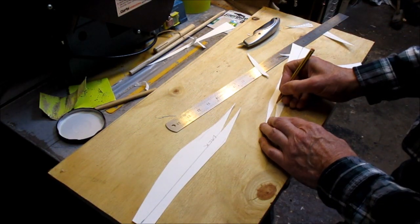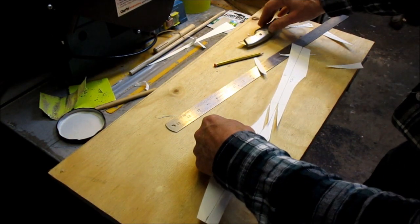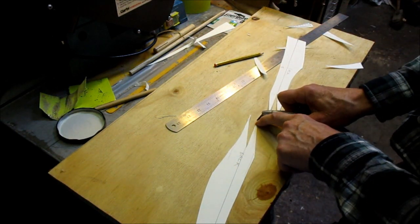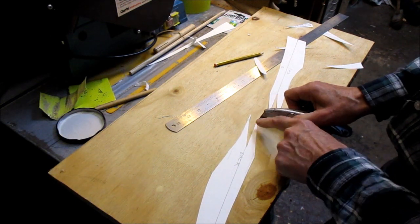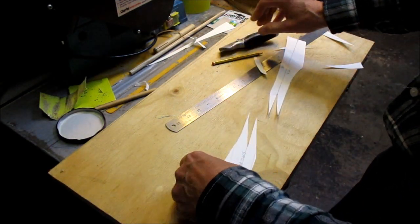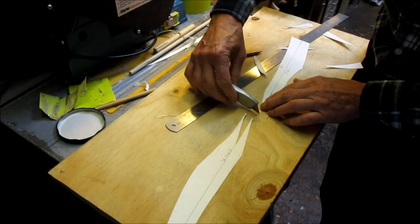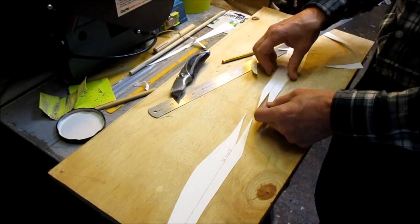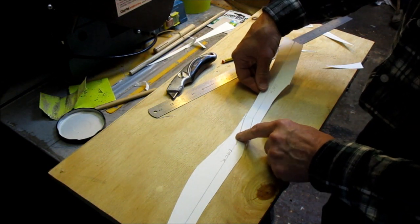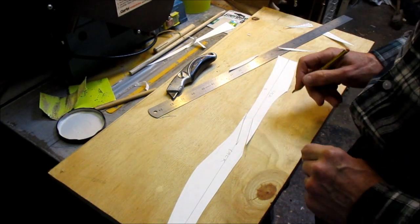On a bandsaw you're going to get a slot there a bit wider, and this point is going to rattle around in it a little bit. So what you can do is you just take that tip off the point with a file or a bandsaw or whatever, just take it off a little bit. That then gets that to sit in snugly. Similarly here, this point, by adjusting the two central prongs, you can get it to nestle in quite nicely. But often you still do end up with a tiny little speck, a tiny little hole there showing.